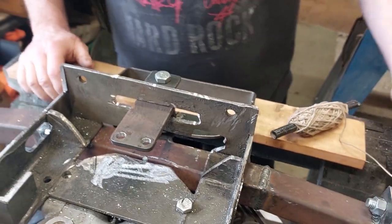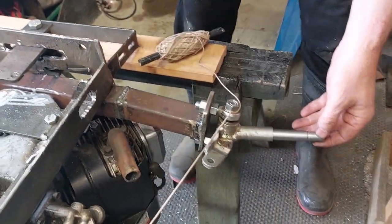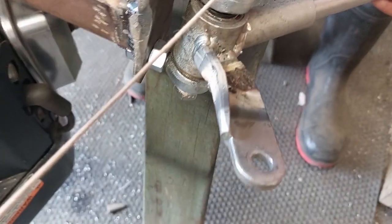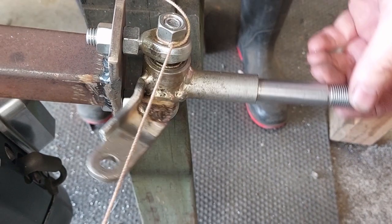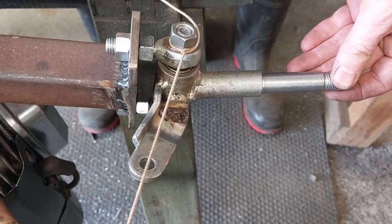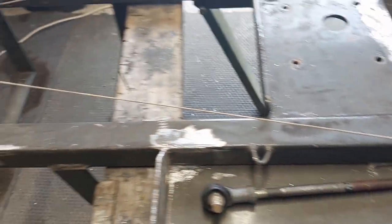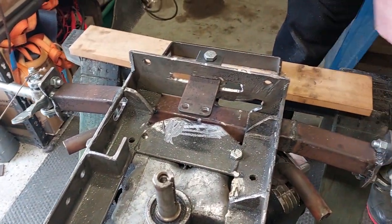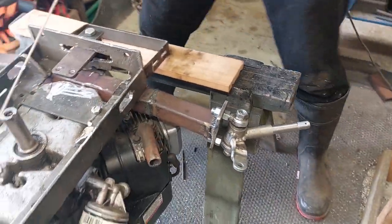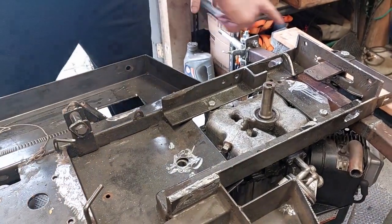So the next thing we need to look at is, we talked about these axle parts here, so we wanted to bend these in so we could get the Ackermann right. Effectively what I did was cut through there, and then with a bit of string and it sitting in the right place, with it straight through there, it should be basically going straight through the centre of that hole. So it goes straight down to the back of the axle, and it gives us our Ackermann setting. So we've now got that correct, and yeah, they worked out quite well.